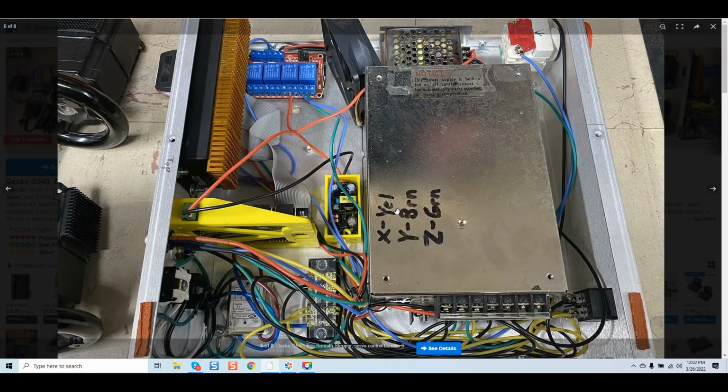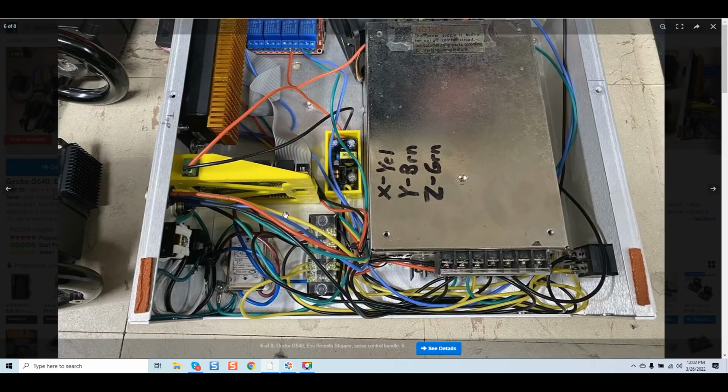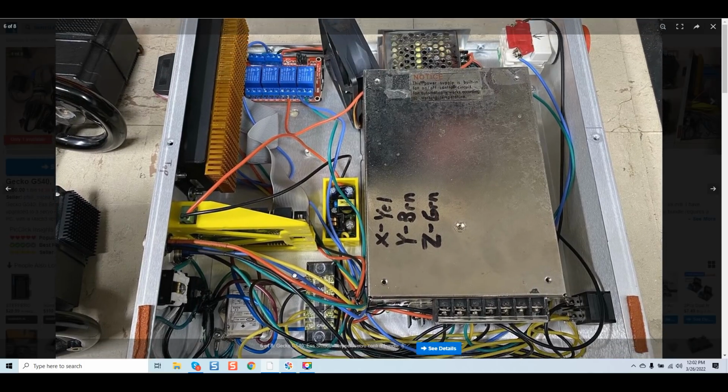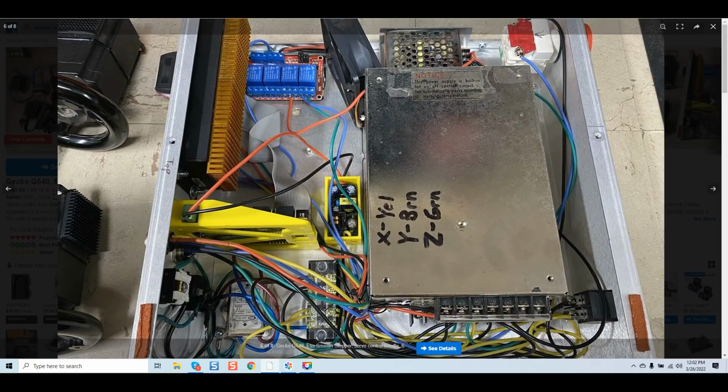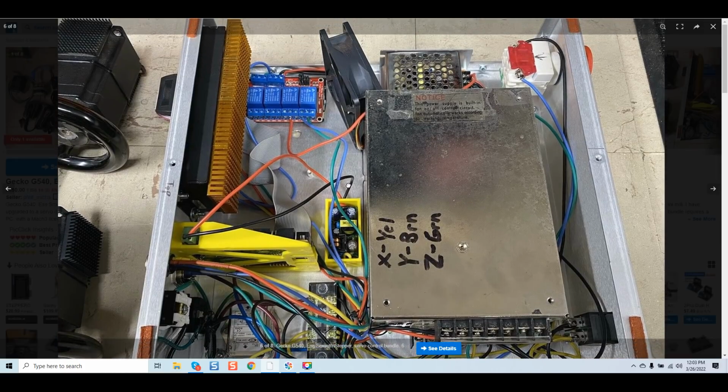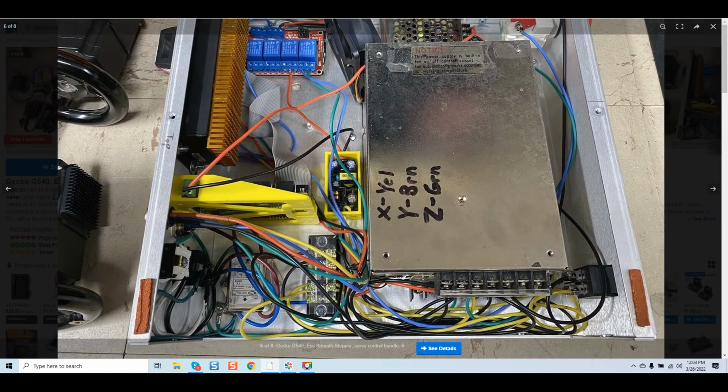Now, the prices on both the systems I just showed you, one was, I believe, $350, one was like $400. One is already sold. It already has a bid on it. If you look in this system, you don't see anything with grounds other than these two over here, and we see no shield drains, no signals being properly double shielded as far as cabling, no ferrite installs, other than this EMI filter over here, which, again, we have no idea where that's actually going. I'm assuming it's just covering the power coming into the system.